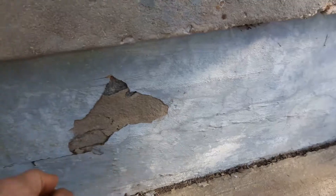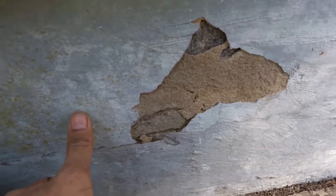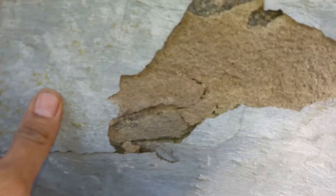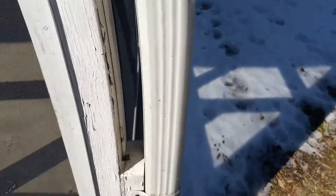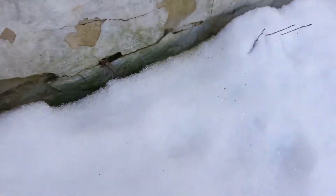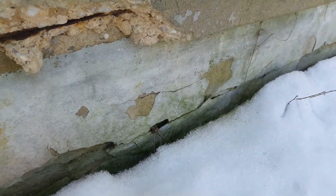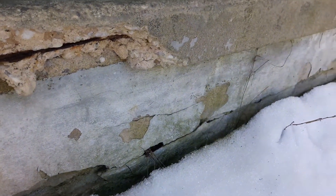No big deal — you just break this stuff off and redo it. Tap it and it sounds hollow; those are all the weak points. You can literally push on it and see it deflect. Just tear it off, hammer it down to the bare surface, and make sure you have a subsurface that can actually hold your stucco. I'm a freak on fiberglass — use a fiberglass reinforcing product. There are a few companies that sell it.